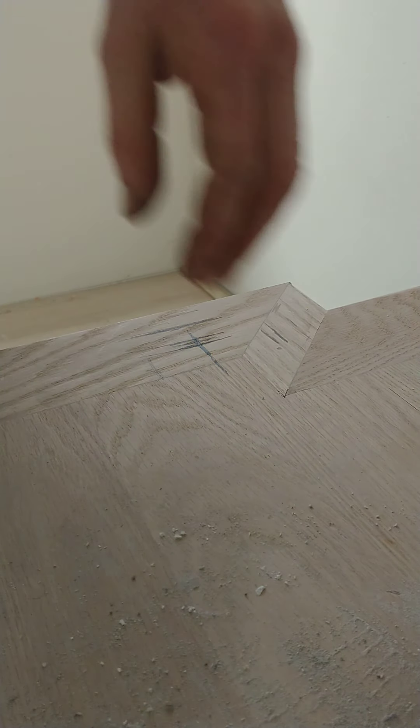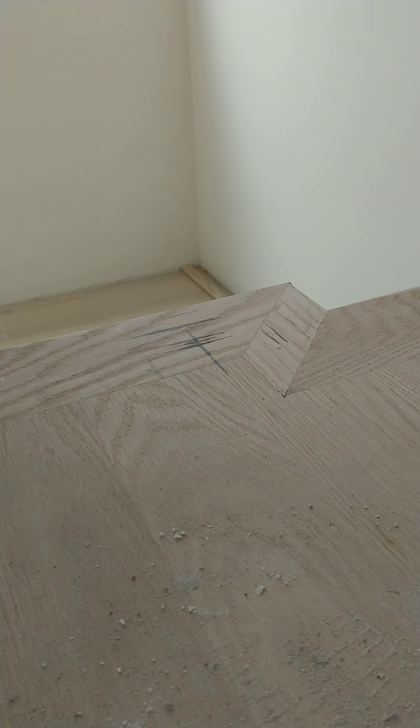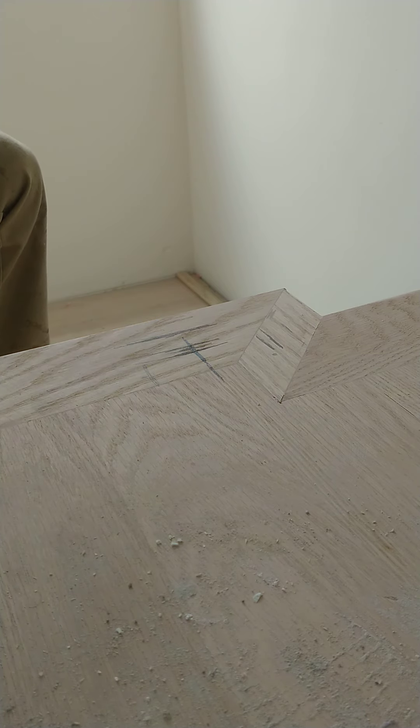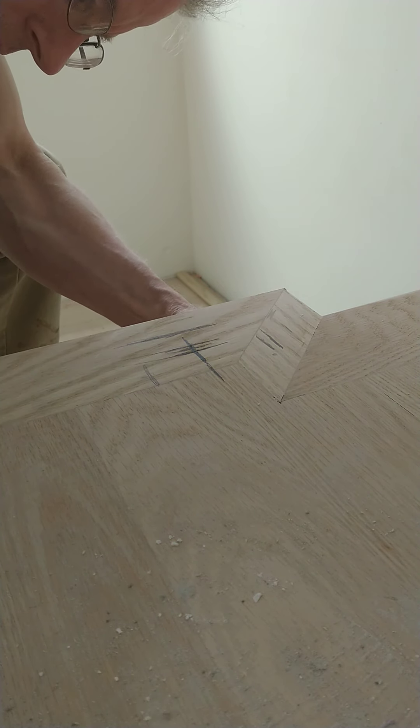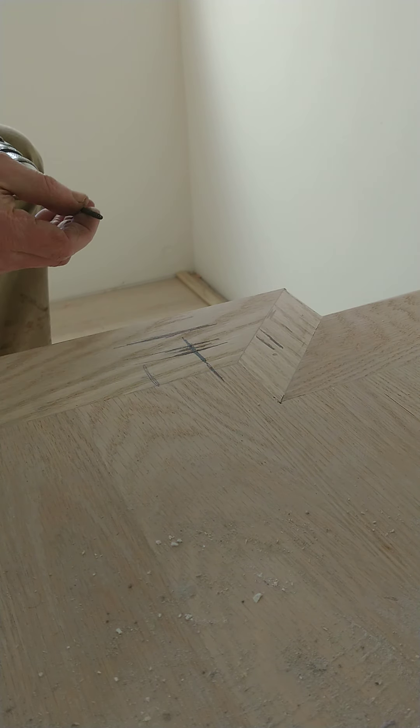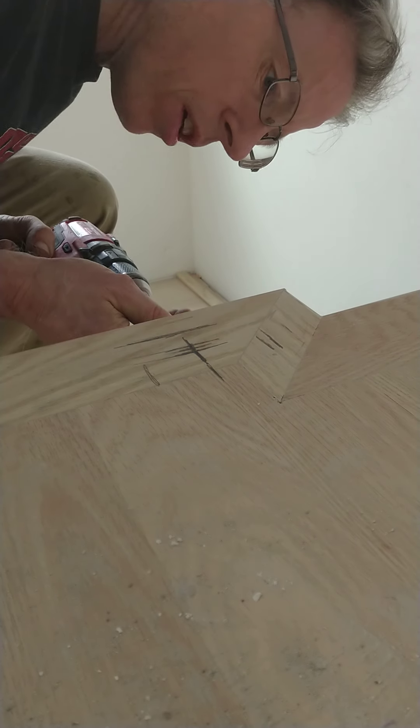So I've got my drilling fixture - this is the cool part. Before you drill, you want to put this board I made here - screw that to the outside of the riser, because a lot of times when you're drilling, it's going to bust through the riser because they're just half inch thick. These are three-inch screws, a little overkill, but it helps.